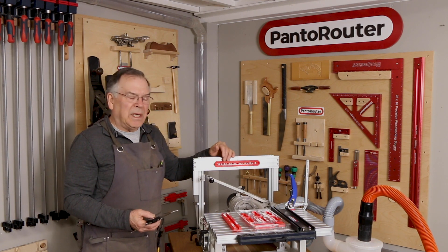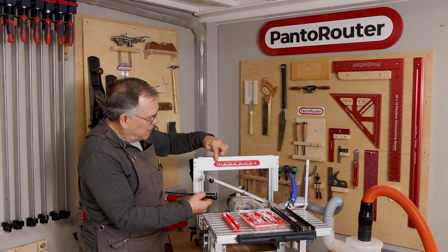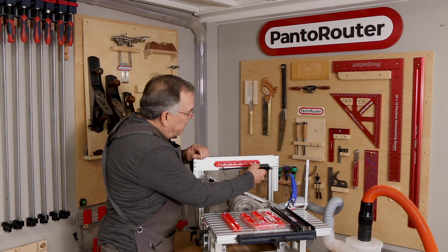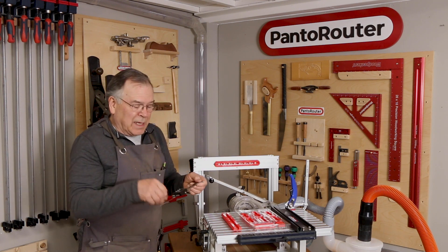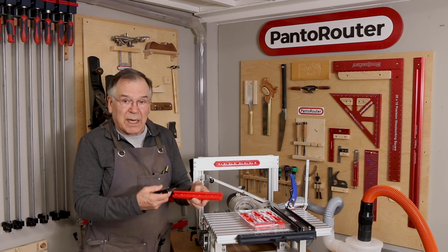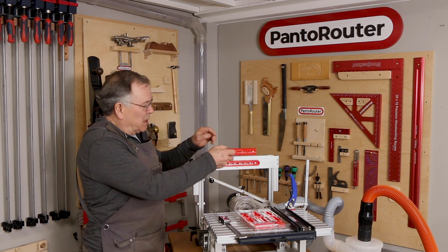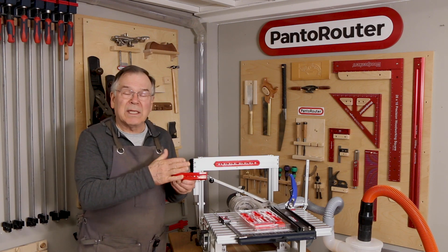So we've proven the size that we need. Measuring from the inside of this end piece to the inside of this end piece, we get 154.58 millimeters. So that's what we're going to cut our straight piece to. We're going to center that on the centering hole, and that way our customer will be able to very easily put this back in the center any time they want to recreate this exact cut.